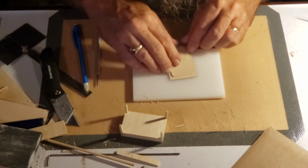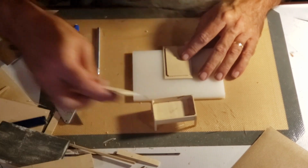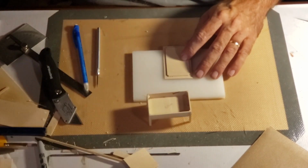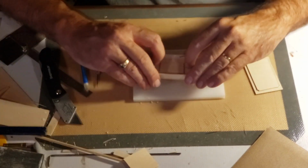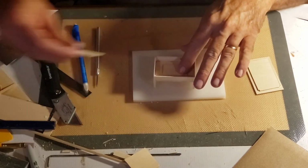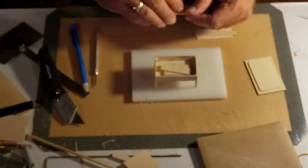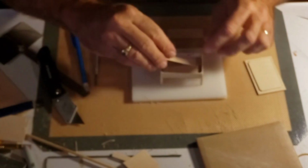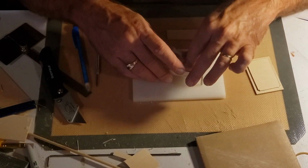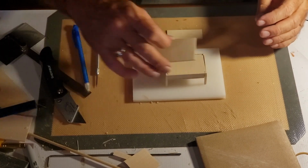it together. And rather than trying to eyeball that, you'll see I do something here where I take a bunch of scraps and put it inside of the actual table there with enough space for me to be able to set the piece that goes in this inside of it towards level with the top. You'll see what I mean. Now I can set that there, and it's nice and even with the level with the top of the table.